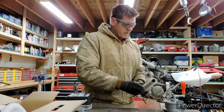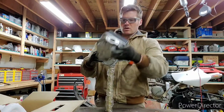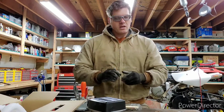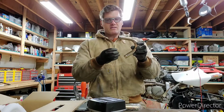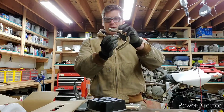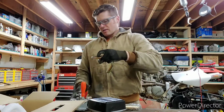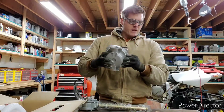What I'm actually gonna do is put my suction tube on my pump like normal, but I'm gonna put the meter on the out port. And I'll show you why. Because my plan is to take this 1-inch reducer, I'm then gonna take the 3/4-inch fine pipe thread that came with the kit, and cut this down to about here, and weld this to the reducer like that. This will give me a 1-inch pipe thread that will go down to a 3/4-inch thread that I can mount on the end of my pump, which will then go into my meter,